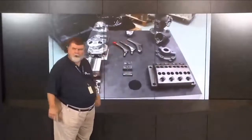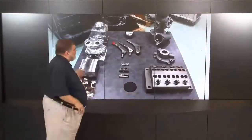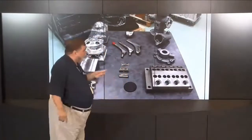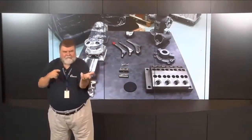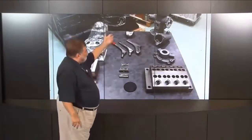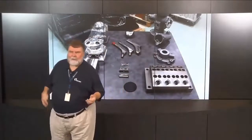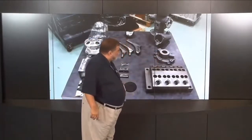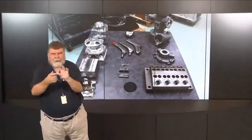In the top right corner, that's a die-cast aluminum steering housing with features all the way around the part on odd angles, cross-sections, and intersecting bores — a classic five-face machining part where you set it up, work around it on five faces at compound angles with multiple side access. Many hydraulic components have similar machining. The next part down is also a die-cast aluminum automotive pump cover with a lot of machining around the periphery and angled holes — you could set up multiple parts and work your way around.